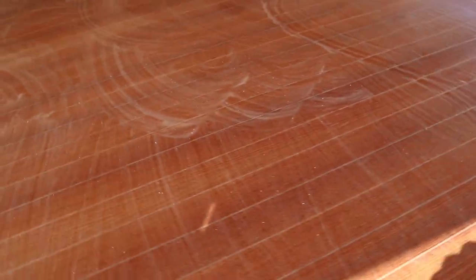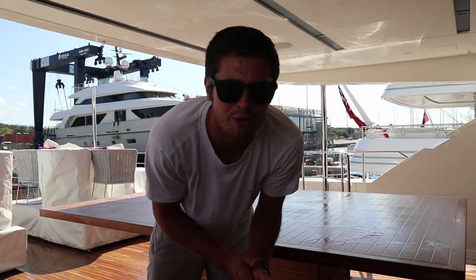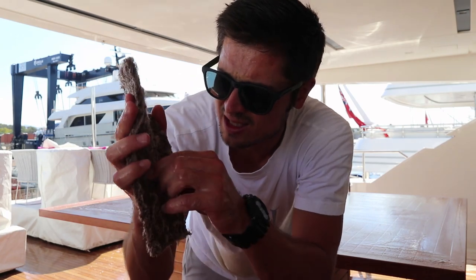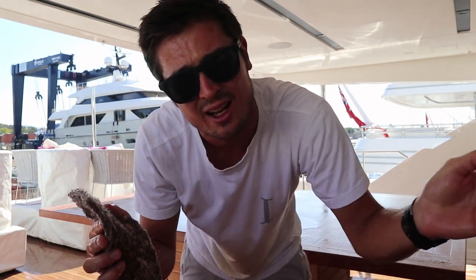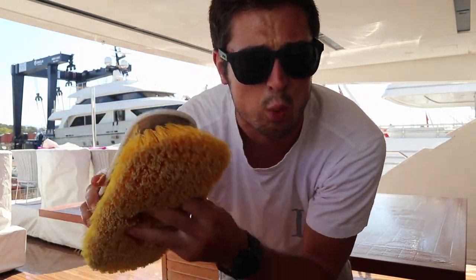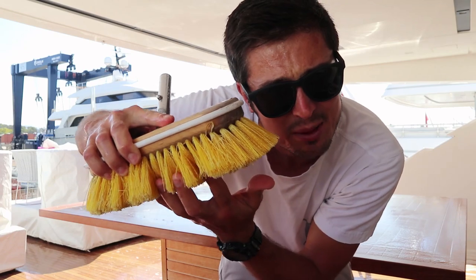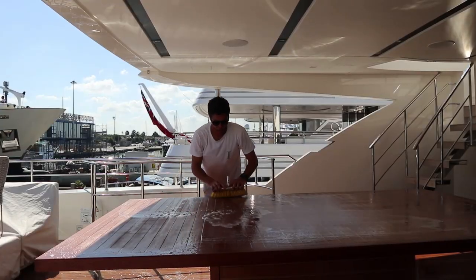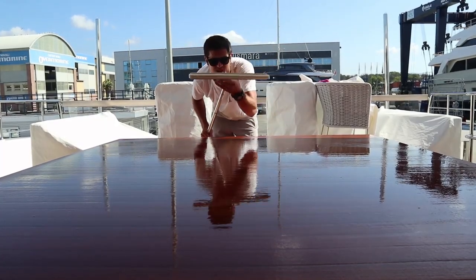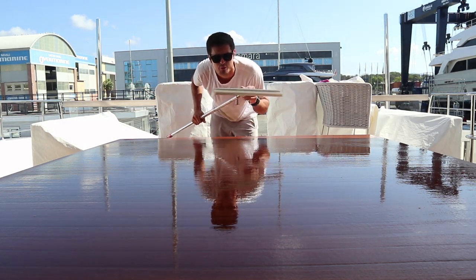Afterwards you'll see it starts to gather a nasty layer — that's just wood pulp and stuff coming off the table, which is exactly what you want. Time for a good rinsing to get everything off, then there's a second step. The reason you don't scrub with the grain is that the doodle bug fibers catch onto the wood like a splinter and rip the fibers off, damaging the teak badly. The brush doesn't have fibers that catch, so you can go with the grain with the brush — it tickles in between all the little fibers on the wood and cleans inside where you wouldn't be able to with a doodle bug. This is just to make sure you've gotten everywhere within the teak. Next step: get rid of all the water — the squeegee comes in to get rid of all the water and make sure it's nice and dry for the last and final step.